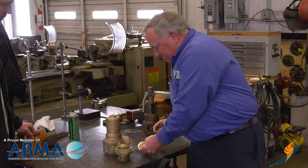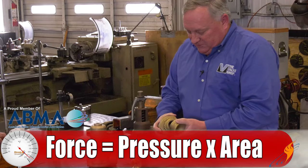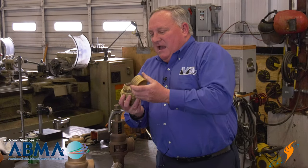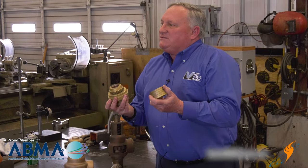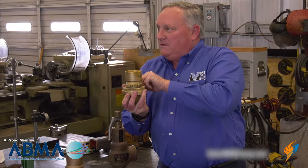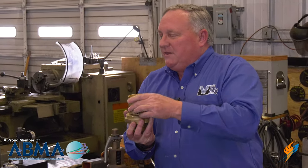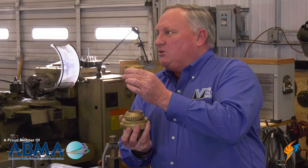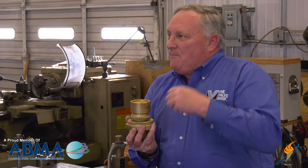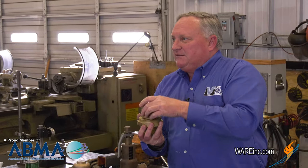Notice the disc is slightly bigger than the nozzle. Force equals pressure times area. So with 100 pounds of force coming down and 100 pounds up, nothing happens — I can't increase the pressure, but I can increase the area. As we get up to 100 psi, steam begins to simmer out around the disc, causing a larger effective area and a greater force than 100 psi. The disc lifts — boom — it pops open. When pressure is relieved, it comes back down. That's why it pops open at 100 psi: we've increased the area the steam is working on.